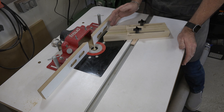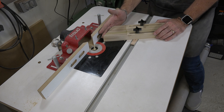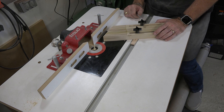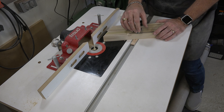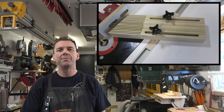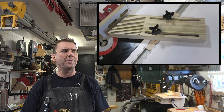You can adjust it as per the thickness of your stock and once you get it where you want it, just lock these down. The maple spreads apart in that miter slot and it is rock-solid — I'm moving my table here so it does a great job at locking it down. The thing I like is that these fingers are flexible — because they're 1/8-inch poplar they have quite a bit of flex to them, yet they'll give a good jam to prevent kickback, whether used to hold your stock against the fence at the router table or to keep it from kicking back at the table saw. Just remember to keep it behind your blade. This one was made primarily for the router table, so that's where it's going to live.